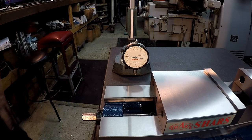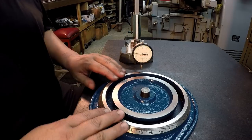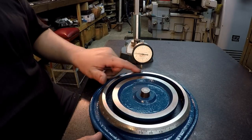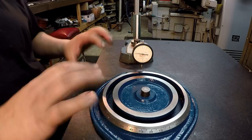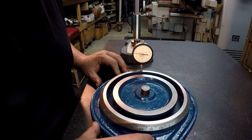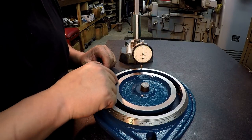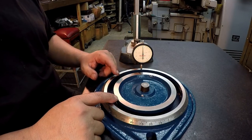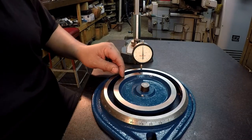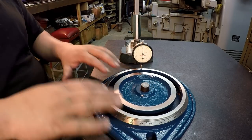One last test — we need to get the swivel base over here and check it just like we did with the vise. Going to check this swivel base and see if it's anywhere near the same tolerance. I slid it up and tried to set a zero as best I can. It seems like everything wants to settle once you let go. I noticed they paint this after they do their grinding inspection — there's a little edge of paint right here that I'm going to have to scrape off before I mount the vise down on this.